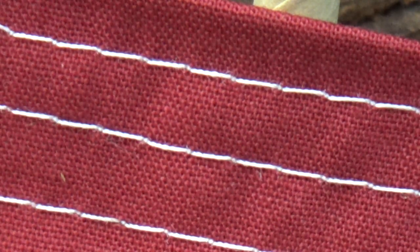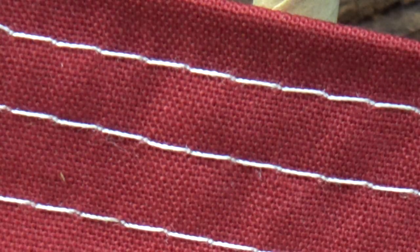Now look at that top row now. I'm going to get my hand off the camera. Look at that top row now where the camera's pointed right now. You can see those stitches on that top row coming beautifully into form. But still, it's just a wee bit underserved. So I will make that adjustment for Barb once we end the premiere, and then we'll do some additional stitching, and then the machine will be good to go for being set up specifically for lighter cotton. But we are just on the edge of it right there. You can see that top row compared to the bottom one where we really were weak on that upper stitch. Now let's turn it over.